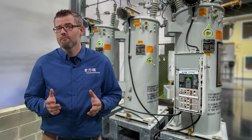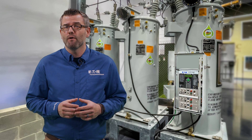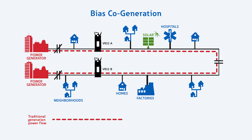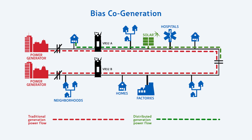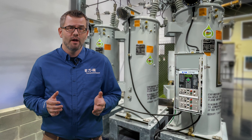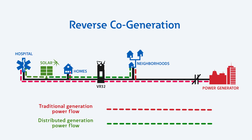The CL7 control has many modes and options to manage these situations. One of the challenges that exists with DERs is managing voltage as they switch between providing power to the grid and being offline. The unique-to-CL7 bias cogeneration mode utilizes the quick drive tap changer's quarter-second tapping ability to test the power flow direction during times of low detection confidence, and utilizes those metering values to decide on regulation direction. The reverse cogeneration mode is utilized when the generator is on the source side of the regulator. Combining both modes by adding reverse cogen as an alternative configuration can help to properly regulate on a circuit with a high density of cogenerators on both the load and source side of the apparatus.